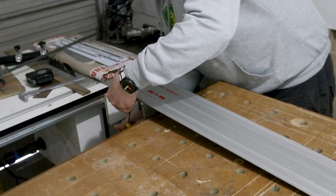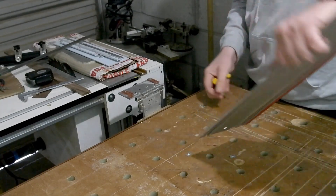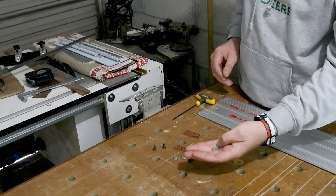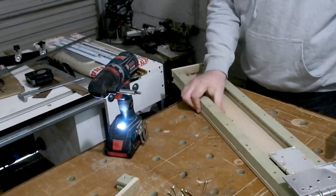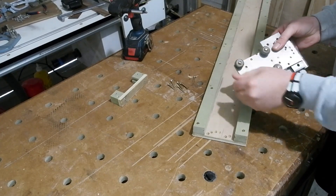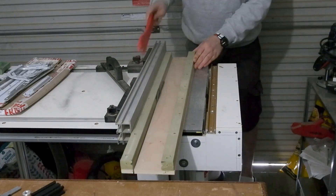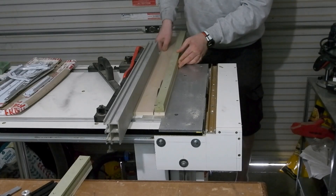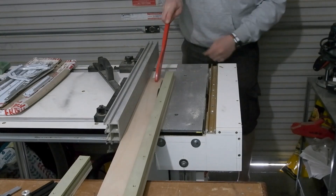Disassemble first. If you have Bosch or Mafell rails, you'll know the underside slots are super slim. I use these flat sliding T-nuts to attach the rail to the plate — the type made for 20mm alloy profiles. Top tip that one. Using these V-wheels and homemade tracks is really cost effective and works perfectly. My main reason for changing them out for a linear rail is the hardened steel on the linear rail will provide an easy central locking point, as you'll see shortly. I'll link my original video in the description for those wanting to see how I made the V-wheel tracks and hinge plate.